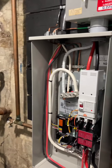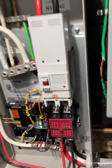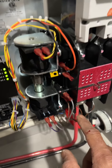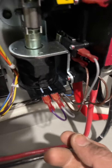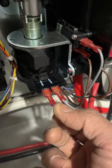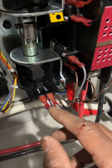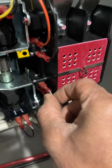The first thing I do when I come to a startup is take a look at the transfer switch. This is a little bit of an older transfer switch that has this purple wire here. The new ones do not have the insulated connector, so this one in history shows us that it's been loose. The electrician probably tightened that down already, but that's one point you should look at — I just tug on all of these a little bit just to make sure they're seated very well.